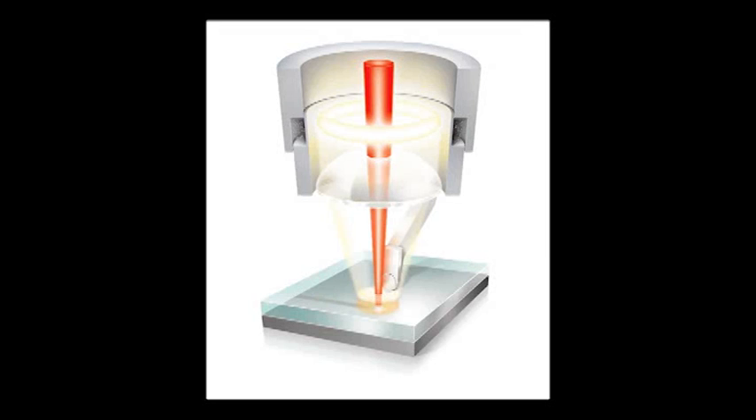That's a segue into hybrid laser welding. There are competitors that offer robotic arm-assisted laser sources, but with LPKF's hybrid laser welding technology, we're able to take a halogen lamp assembly in combination with the laser. The halogen lamp is behind the collimation lens and focuses the energy onto and around the weld surface to actually anneal the plastic, essentially assisting the laser source with a high-powered halogen lamp.